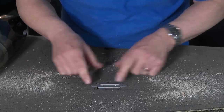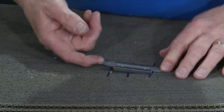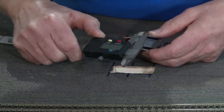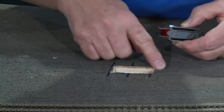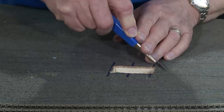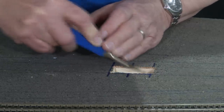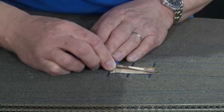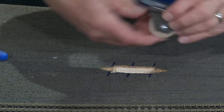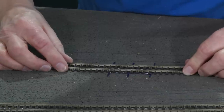That's just fine. Now obviously I need to remove some of the cork around the outside here — cut that away so the solenoid sits flush with the cork. I've popped it in the hole and drawn around it. This cork is three millimetres thick, whereas the depth of the solenoid flange is 1.9 mil — let's call that 2 mil. Just a case of taking a scalpel and slowly nibbling away at the depth, and there we are — looking nice and flush.